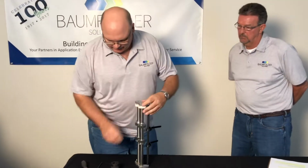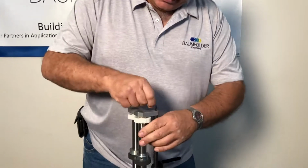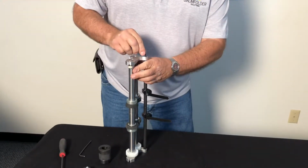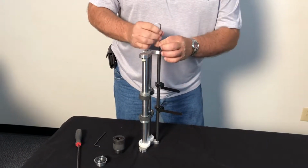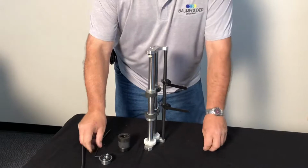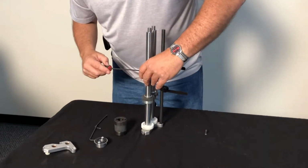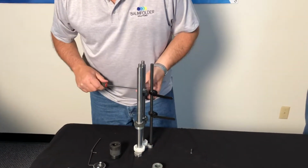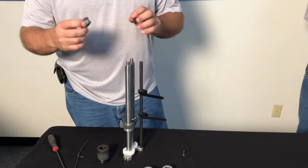Then, taking a 3mm Allen wrench, you can loosen up and take out the flathead screw opposite of the gears, which is always easiest. Lift this out, lift the end cap off, then you can take these two draw roll wheels off. We call them pull-out tires. Then you can put your scoring tooling on.